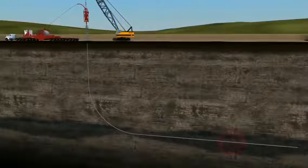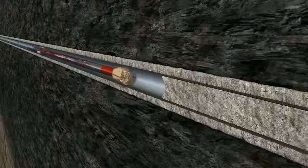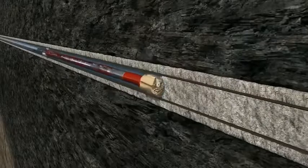The second run uses tubing-conveyed perforating guns to perforate the toe, allowing injection to the wellbore. Weatherford's Flowmax perforator allows this operation to be done in a single trip through the use of a flow-controlled valve, saving operators up to 30% of the cost for this routine wellbore service.